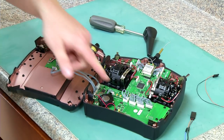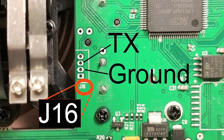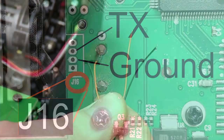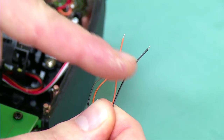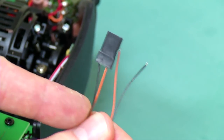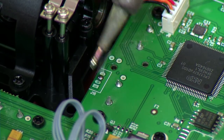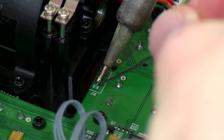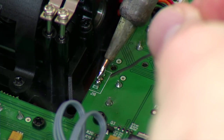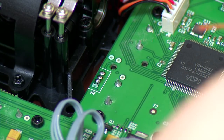You'll see that we're going to be accessing these ports right here. Looking at the diagram, we're at J16. There are four holes and we're using the two middle ones, labeled TX and ground — TX for signal, ground for ground. I've taken my servo lead and stripped it down to expose the signal end and the ground. We've got the other end that we're going to fish out through the back of the DX9 and solder to those two pads. We're going to tin those two pads — the second one down is TX, the next one is ground — and apply a little bit of solder. Now I've got those tinned, and we're going to solder our signal wire, which is the orange wire, to the TX pin hole — it's the second one down.